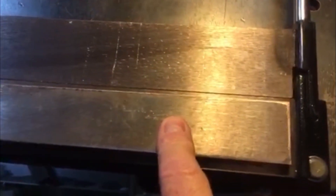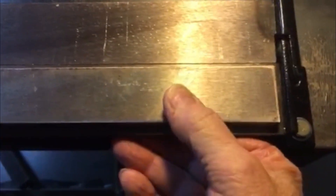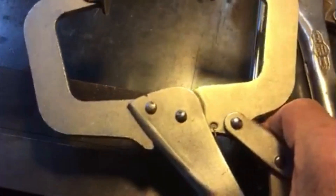So here it is, mounted on my workbench with quarter-inch bolts. As you can see, the handles on the machine slip right in, no problem. This is what they call the pressing plate according to the instructions. As you fold your metal up like this, with this properly gripped down, the vice grips work excellent — but don't try to use these clamps. They don't work. They'll move that bar, your metal will get distorted, and you won't have a correct bend.